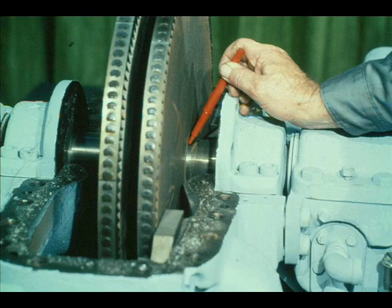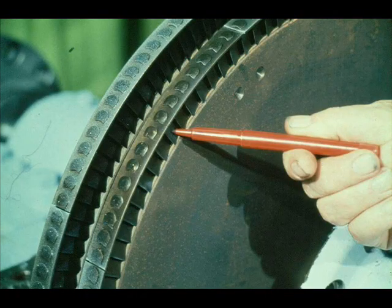This is one of the two wheels. It is mounted on the shaft with an interference fit, and these are the buckets mounted on the wheel. These buckets are made separately and then mounted on the wheel. However, this is not always the case — some small wheels may be made with the buckets built in as one piece. In most cases, though, the buckets are made separately and mounted on the wheel, as you see here.